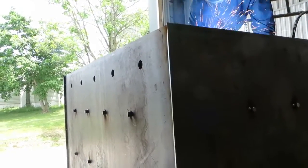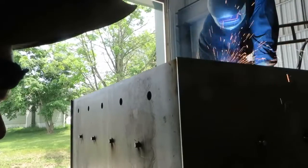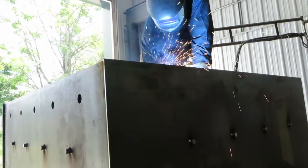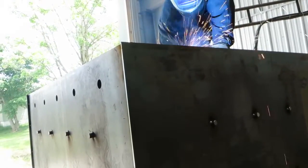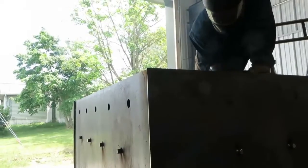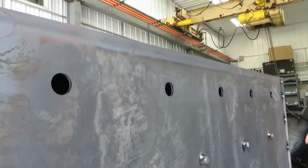It's easy to access and clean out. The other nice thing about the box is it's big enough that it actually acts as a fly-ash trap. When you're burning biomass, you get a lot of fly ash circulating through the firebox and through the fins down into here. When it goes out the back, sometimes it changes direction to come out the top, and that fly ash drops out. There's a little clean-out on the back to take off and clean that out, which you should do every time you clean the fins.